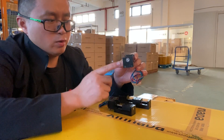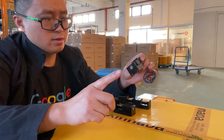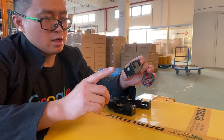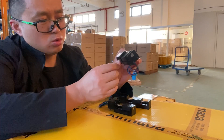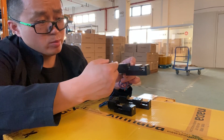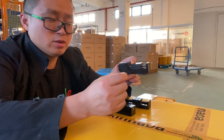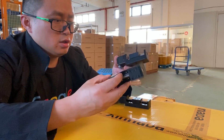So if you have a longer working length like 300mm and you want it to work fast, then you will need the larger pitch option, the TR6 plus 12 as mentioned. But if you want to travel slowly but with higher position accuracy, then you just need a smaller pitch like 1mm, so you will need the TR6 plus 1.